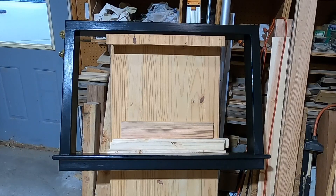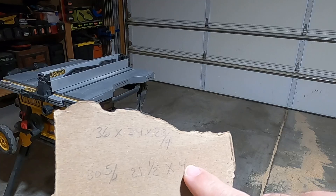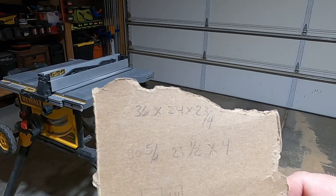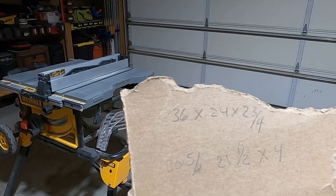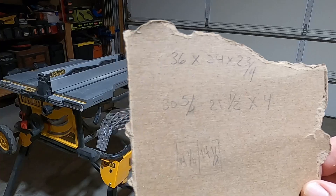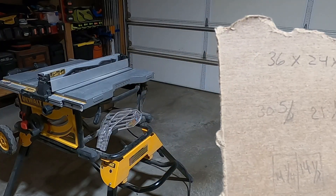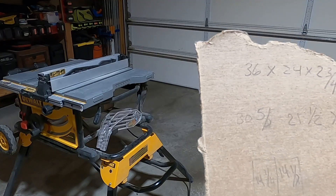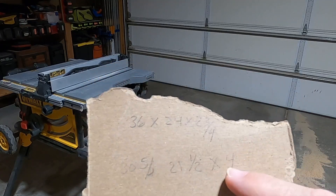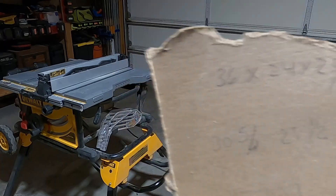Because this is four inches deep and I know that I need to add one and a half inches to that — that's for the part that sticks out past the wall — five and a half inches is what I need for my sill plate. And then I need four inches on the sideboard, so let's go ahead and cut the four sideboards first.